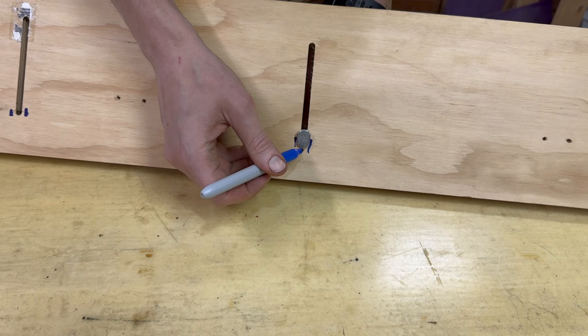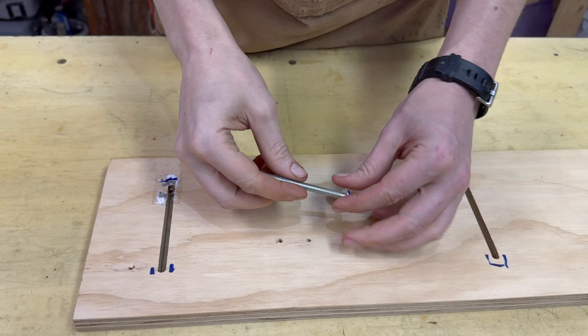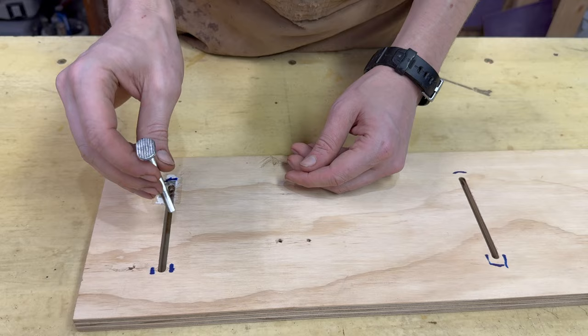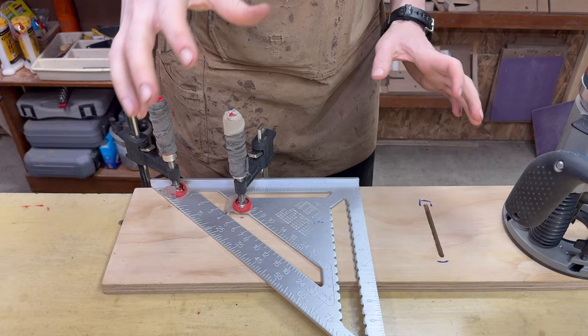Go ahead and do it for both sides. We're also going to mark the furthest-out area so we can route past it and let the head slide all the way through — mark that on both ends. For standard generic T-bolts, go down just about an eighth of an inch or a little over into the slot; that generally lets the head sit nicely under the bottom of the jig. An eighth of an inch is usually an automatic measurement on most routers, so just use that.